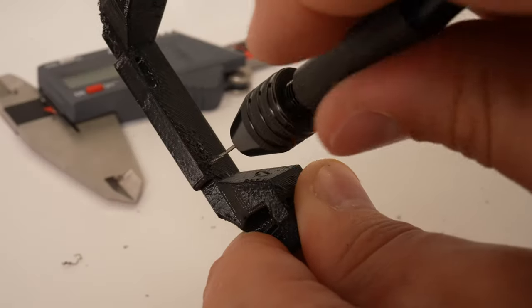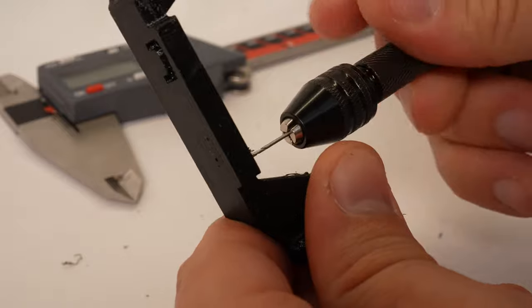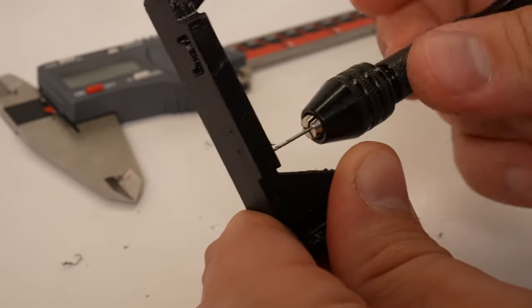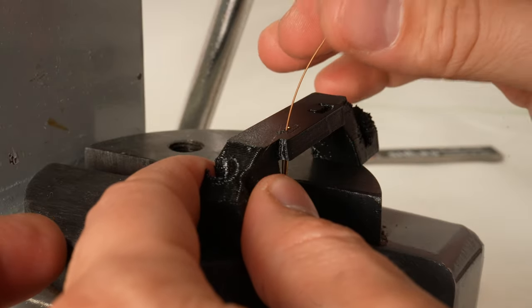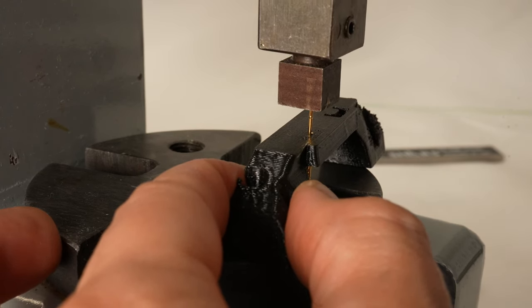Many of the pogo pins have their holes directly 3D printed, but the smallest PA50 style probes for 1.5mm pitch connectors had to be hand-drilled using a $15 micro PCB repair manual drill. The probe receptacles were then pressed into place. The smallest had wires pre-crimped, and the larger were solder cup.